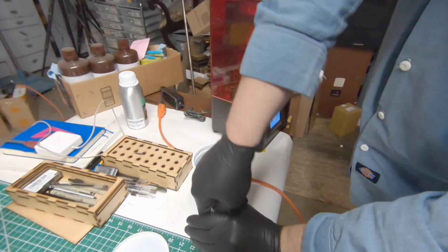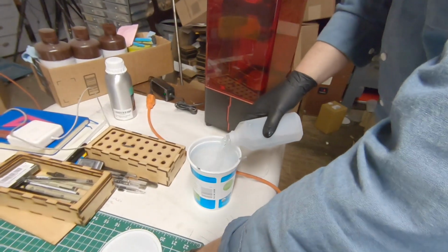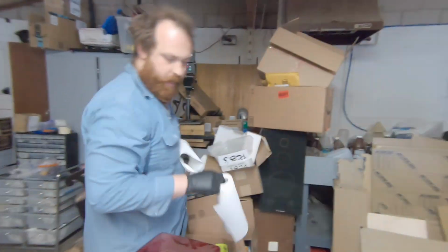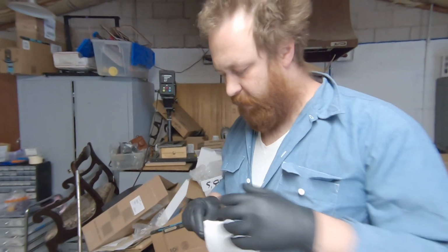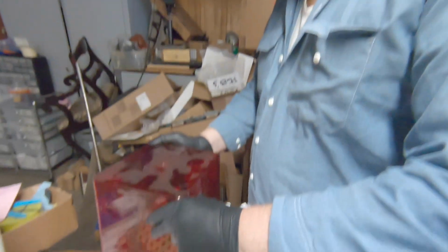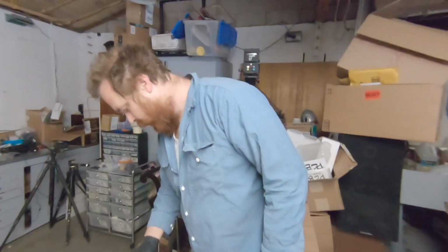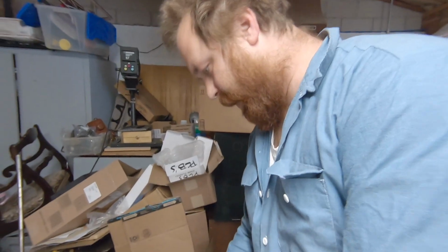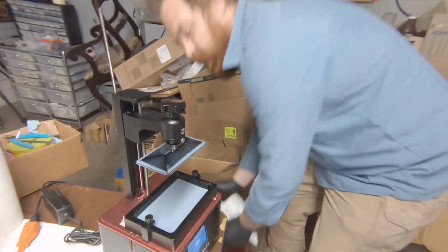Yeah. And you're going to get some alcohol and release it? Yeah, well, so I'm going to take them off and just get this all over my hands. The deal is the machine only partially cures. So you have to UV cure in the sun, which is good because we're in New Mexico. However, you want to get the gloopy galoppies off first, because if you don't, then you have no detail. So you use some rubbing alcohol.